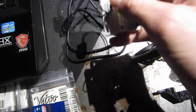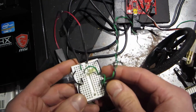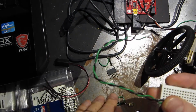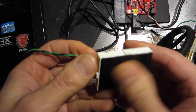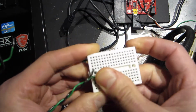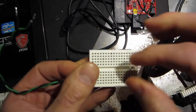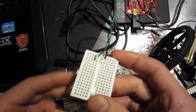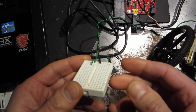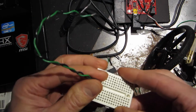Before we get carried away, we're going to breadboard this up, and I'm just trying to find a spare breadboard sitting around the shop. It's like trying to pan for gold or something. Yeah, this looks fairly useless. Breadboarding 101. Oh, this isn't even a good one. This one's had the bottom torn off. You know how that is. These things are so highly capacitive, they're so noisy. If you stick an op amp on a tiny breadboard, you're just asking for transients to show up in your signal. Not that I have anything against tramps or transients or hobos or people who ride the train for free.